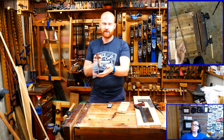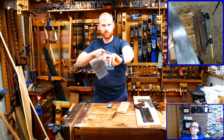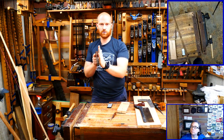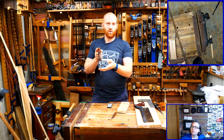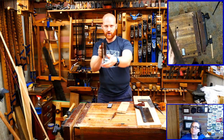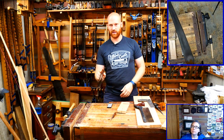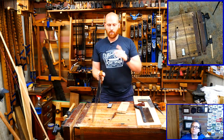There are three ways you can rotate the saw: this way, this way, or this way. The third method - rotating in line with the plane of the saw - doesn't really affect straightness. The other two rotations are the ones used for steering. If you see yourself veering, you'll want to rotate the saw one way - keep your arm in line but allow your wrist to rotate, and that will let you steer it down the cut.